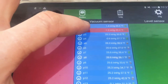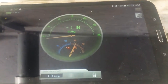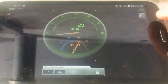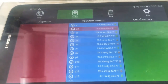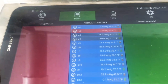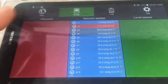P2 is in the red — if we click on it, it's actually making pressure, not vacuum. That line goes underneath the road in a culvert, and we're frozen under that culvert right now. There are literally only six taps on the other side of that culvert where the sensor is. Yes, the line is 1,800 feet long, but that is why it's reading zero right now.